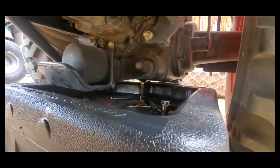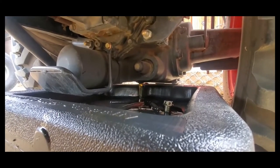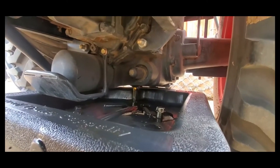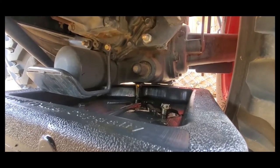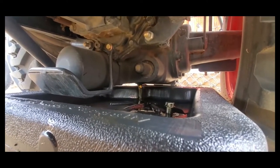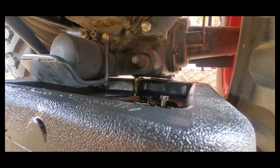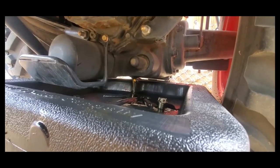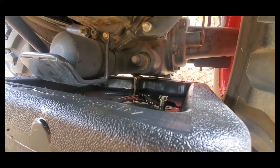The oil is coming out golden colored. You can't think about this like an engine — this fluid just gets pumped around back and forth. It doesn't get pushed between wear parts that cause it to turn black, and it doesn't get heated up by combustion. The oil should come out this honey color. You're supposed to do this about every 200 hours. We're coming up on 200 hours on this tractor — it's a 2016 model we bought in 2018 with about 50 hours on it.